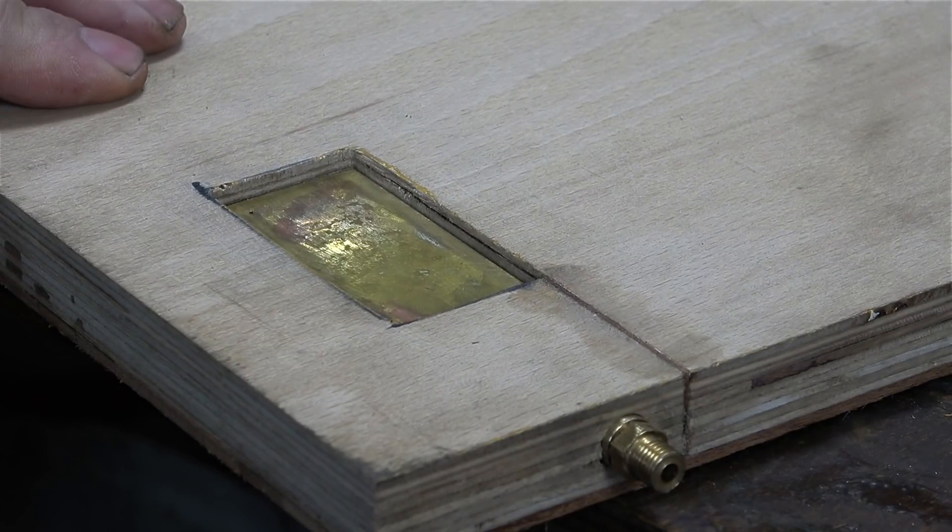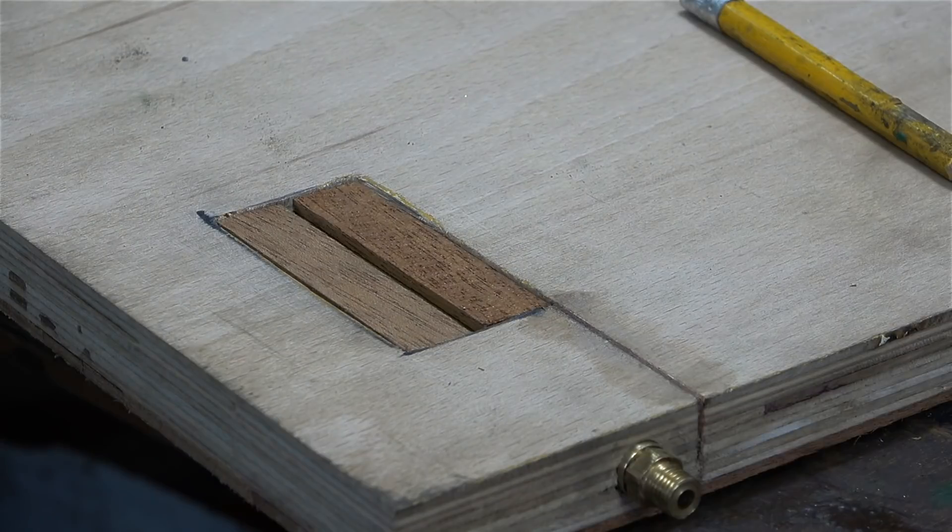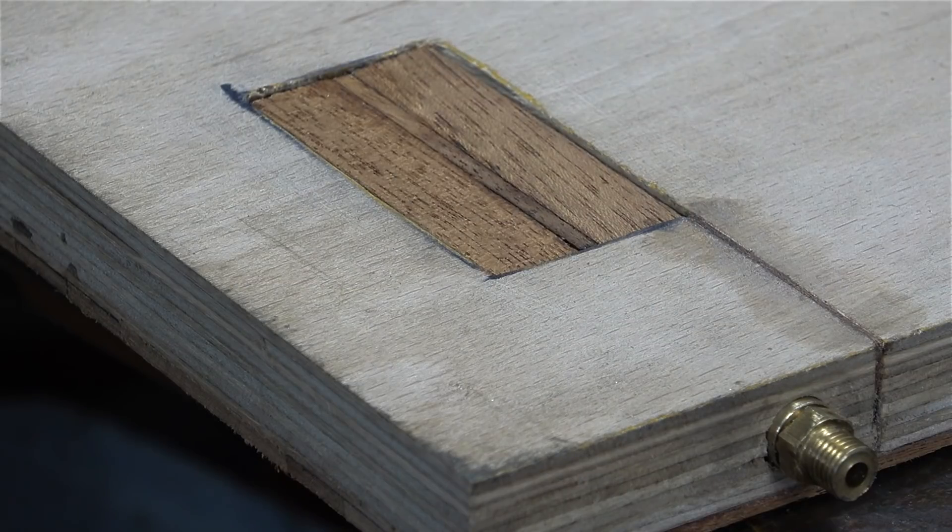This is the underside of the board, and here you can see the drainage sump — I need to fill this hole in. I have plenty of pieces of mahogany left over from the planking job, so these are ideal to fill the hole. I had to cut a very thin strip of mahogany, and here it is fitted in the centre.